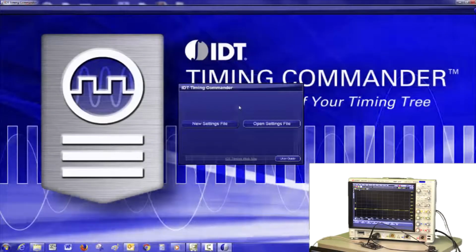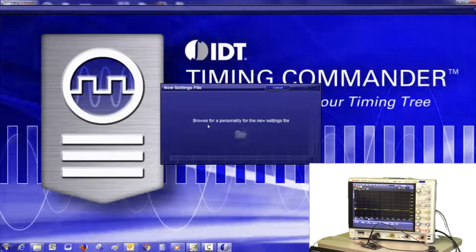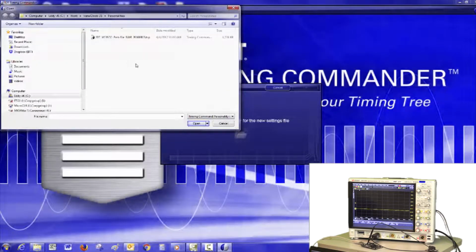The first thing the timing commander software asks you is, do you want to open an existing settings file, or do you want to start a new settings file? I will start a new settings file for this demo, but you can also load something that you've saved earlier. Then it asks you for the personality, and the personality stores all the information for a certain product family. And the personality file you can download from the website. Just go to the VersaClock 3S landing page and download the personality file for the VersaClock 3S from there. So I will now select the VersaClock 3S personality here on my computer.